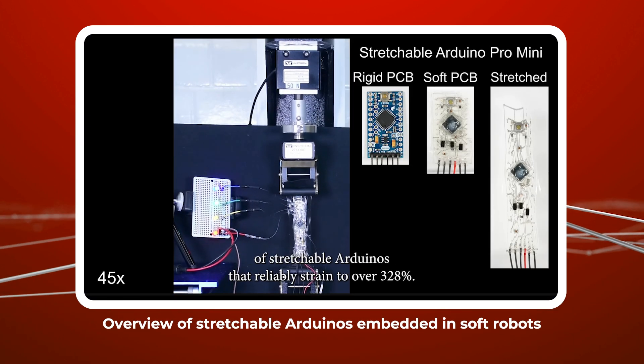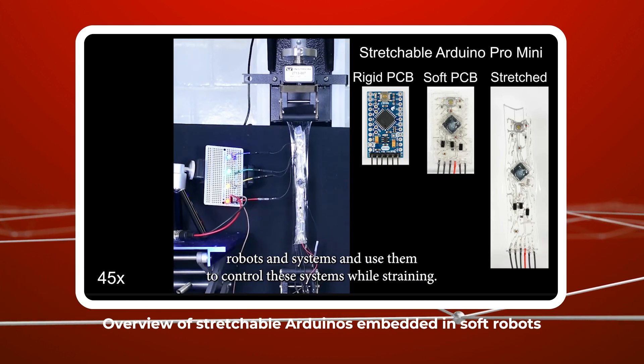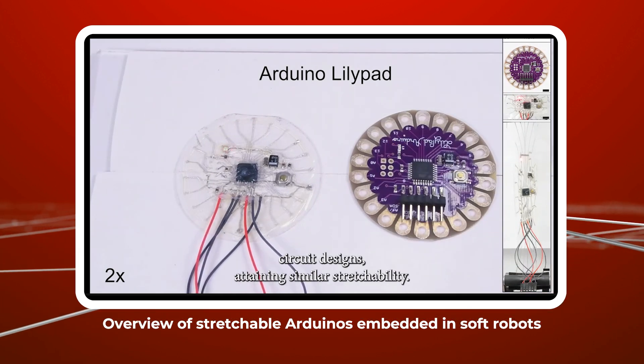What are some of the challenges and obstacles you're facing — the problems you're currently working on, and that you tried to tackle in the paper? These stretchable electronics — at least the ones I'm working on — imagine you have an Arduino or SparkFun board but you've made the substrate stretchable. We're not making stretchable transistors; we use the integrated circuit chips and surface mount resistors. We just make the board soft. That creates challenges because the interface between this super soft substrate and these rigid circuit components is oftentimes a point of failure. We worked especially in this paper to mitigate that interface and reduce the stress that concentrates between the rigid component and the stretchable trace, being the substrate or the stretchable conductor. All the interfaces around that are extremely important.